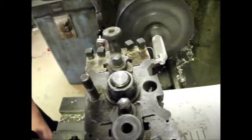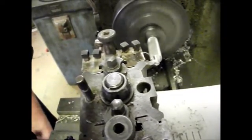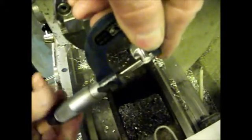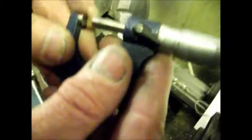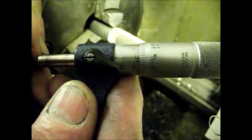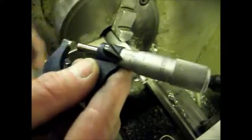When we get a bit closer, we're going to be looking at our micrometer to check what size we've got this down to. So I'll stop now, take a micrometer, put it on each side of the bar, and do it up — not too tight. We can see that that is just under 7mm, so we need to take 2mm off that.